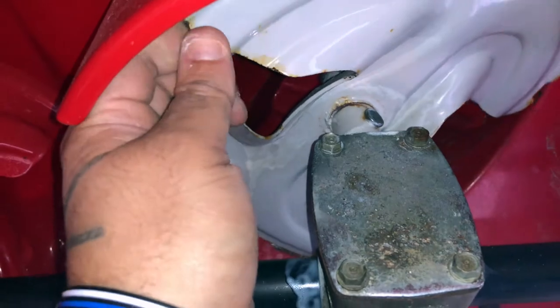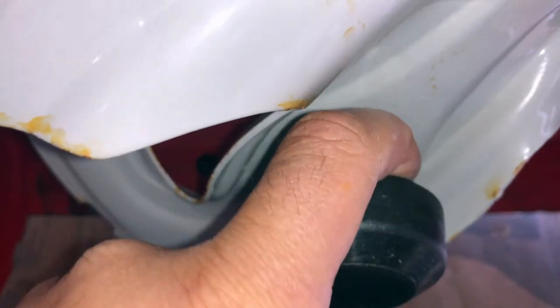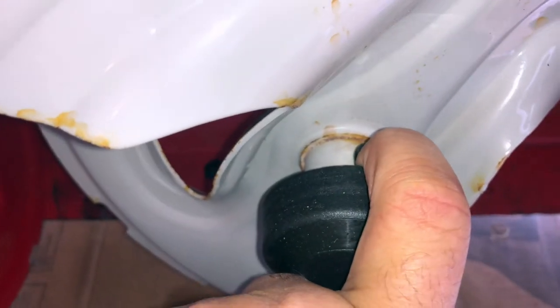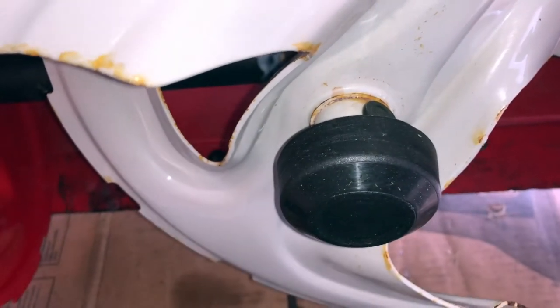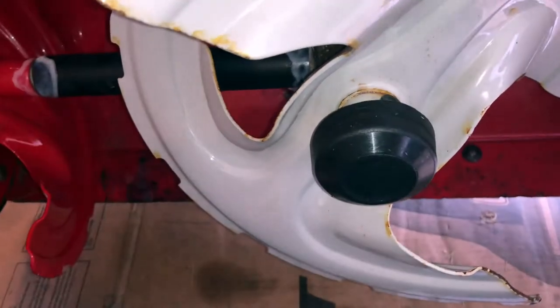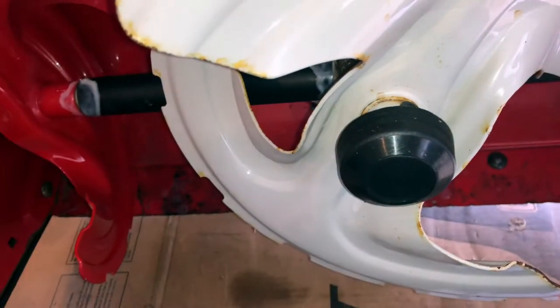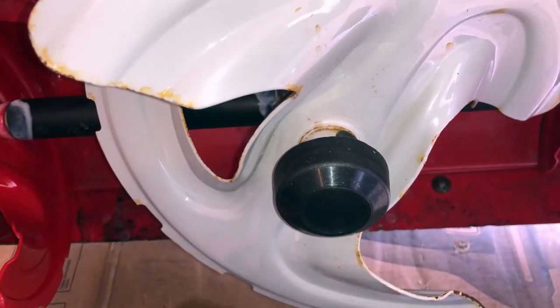Before the snow comes and you're out there snow blowing, you'll want to keep extra shear pins on hand — it comes with four but get another four just in case. We get a lot of ice storms up here, and a shear pin probably broke the last time I used it when I hit a brick of ice, which stopped it from breaking my gearbox.